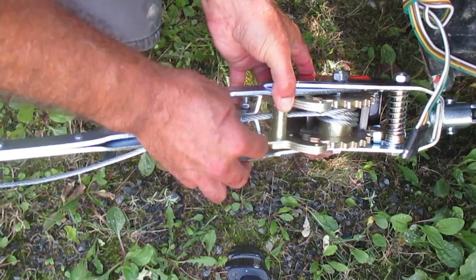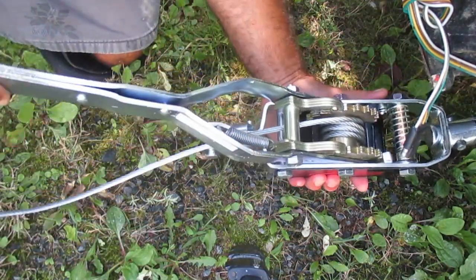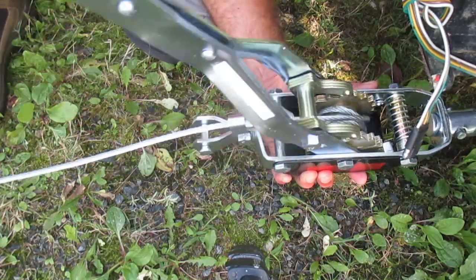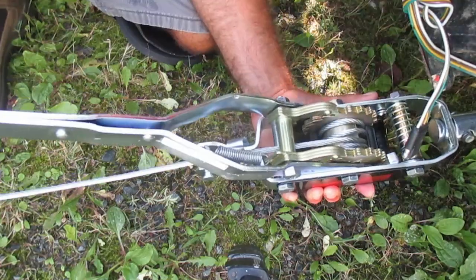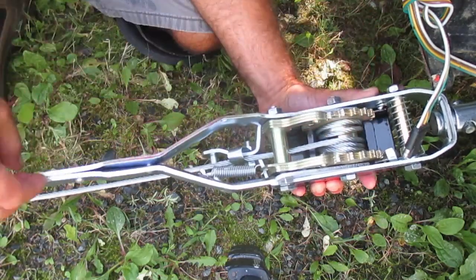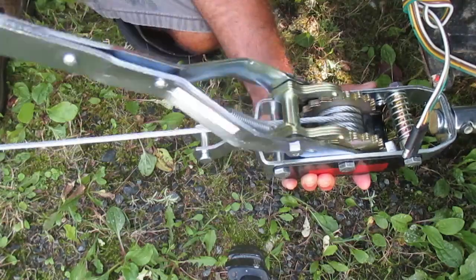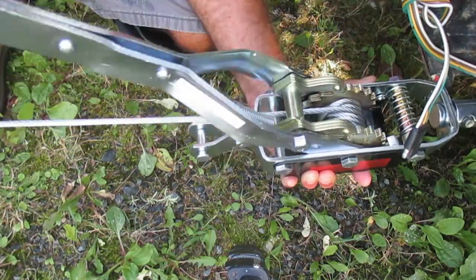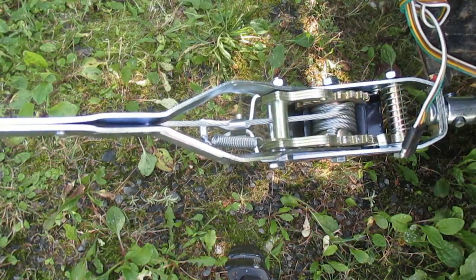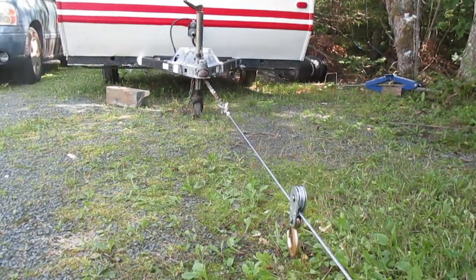The spring is engaged there — just to reiterate: with the spring up it pulls away from the ratchet; pop the spring down and it engages. Watch your hands. We're going fast here until we get some tension in the cable. Note that I had the minimum of three coils of cable around the ratchet. We now have tension on the cable, so I'm going to move the camera back and haul the trailer up the hill.